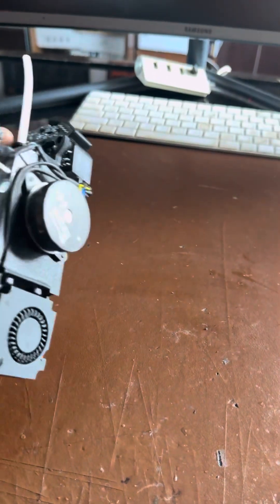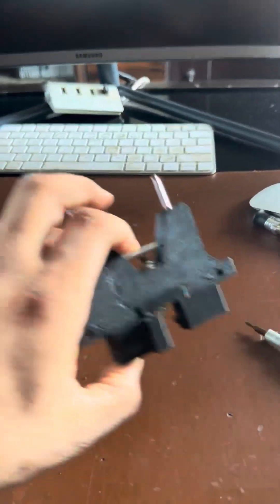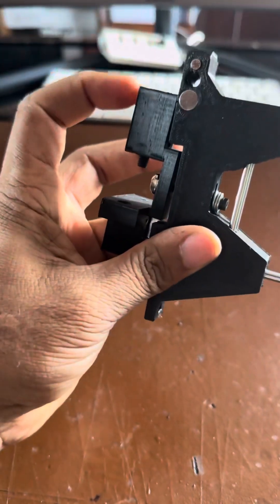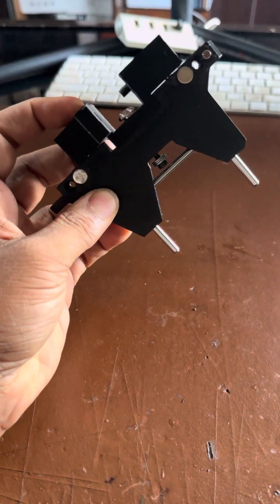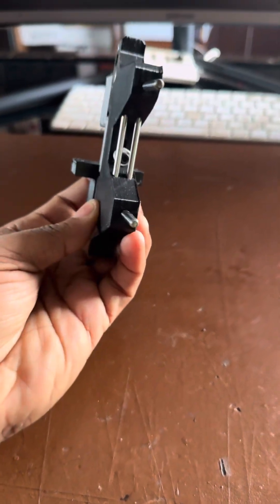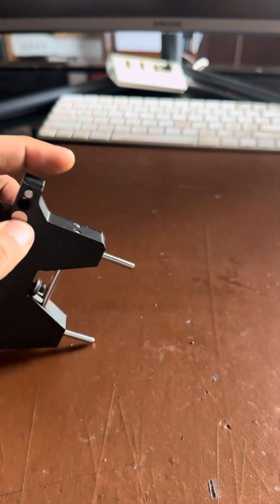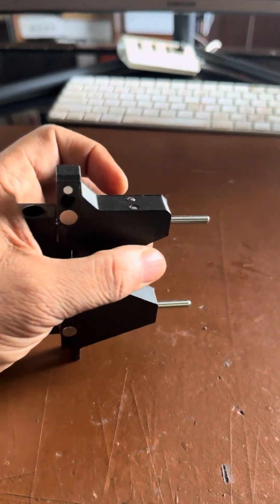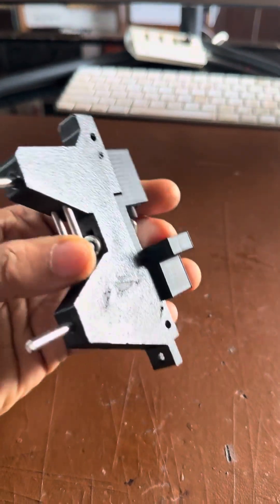These are the docking pins, and the dock is essentially this piece which glues and mounts onto the back extrusion. There is some adjustment built into it, and there are M3 pins for stability and M4 4mm rods for catching the slider on the tool changing mechanism.